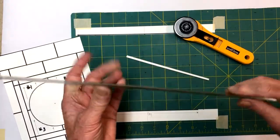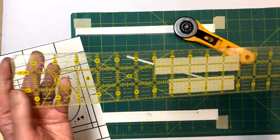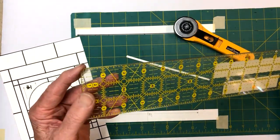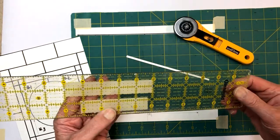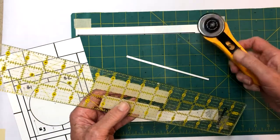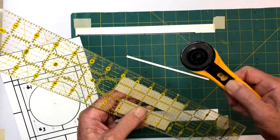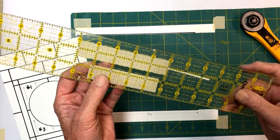The rulers I'm using are plastic rulers used for quilting. My wife is a quilter and some of these I inherit from her - this one here got dropped and broke on the end, so they end up out here in the shop. They work really nice. They have about an eighth-inch wall right here, so when you're using your rotary cutter it just rides up against it. I also use these when I'm cutting glass - it works great along the edge to hold your glass cutter so it doesn't move in or out.